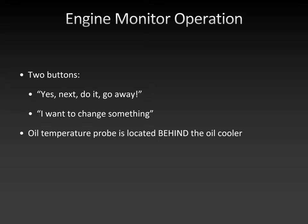So the way you notice that is it is a bit annoying to monitor on warm up because you start up the engine, everything's cold, the oil temperature reads, I don't know, 50, 60 degrees, you get the red warning that the oil temperature is low. And then you sit there running it up and it doesn't get warm. Nothing happens. Like, why is the oil not getting warm? And then all of a sudden goes bam, 80 degrees, 90 degrees, 100 degrees, 110, 120, 125, 130, and then